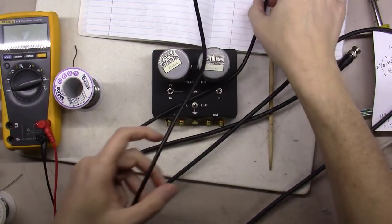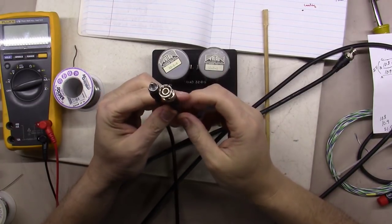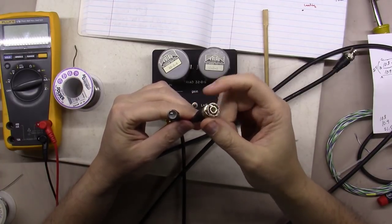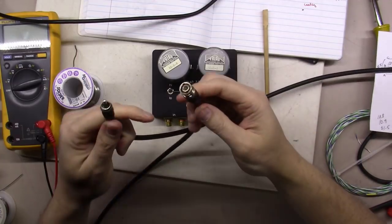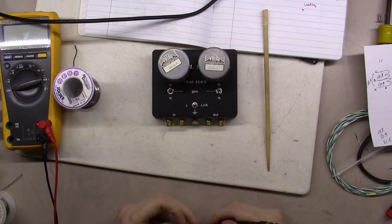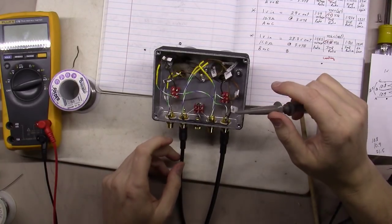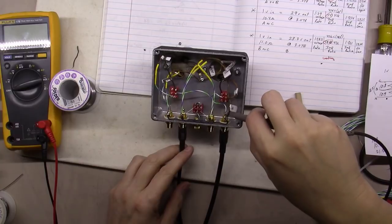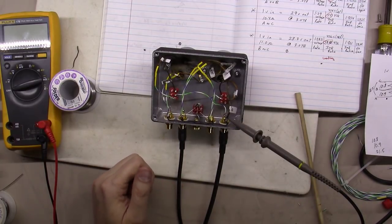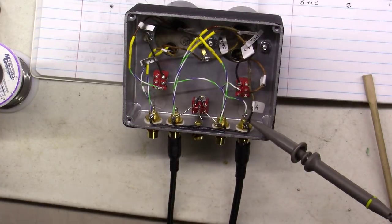For testing I've got a couple of cables — one end is an RCA jack and the other is BNC — perfect for feeding my signal generator into one channel. Another slightly longer identical cable feeds out to my oscilloscope. I'm also using an oscilloscope probe on channel two connected at the input, just to make sure the input phase dots are following the output correctly. You can see the setup — feeding in on this one, feeding out on that one — let's go to the oscilloscope.